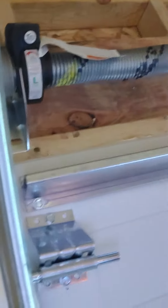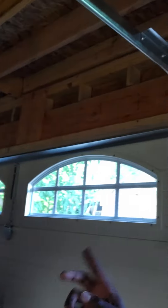I didn't die. But again, like I said, I did screw up because it's my first time. So I got to take it all apart — a couple lag bolts, really it's only six lag bolts — let it up. And I think what I'll do is use the cable with some tension on that spring — that's why this cable is so tight. I'll use that cable and take it up as high as I can with the cable on the barrel, and that will let me know that I'm as high as I can go. And it should be able to clear right here. Like I said, I messed that up — first time putting the door up and first time putting the spring in. But learning here should make it so much easier to do that side.